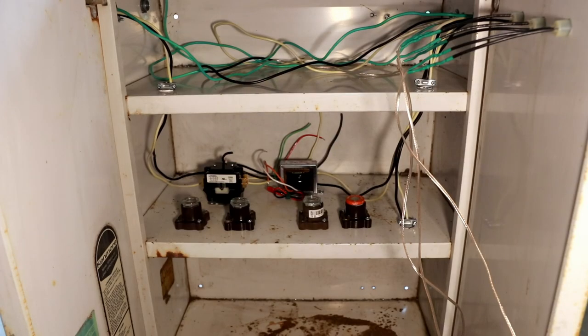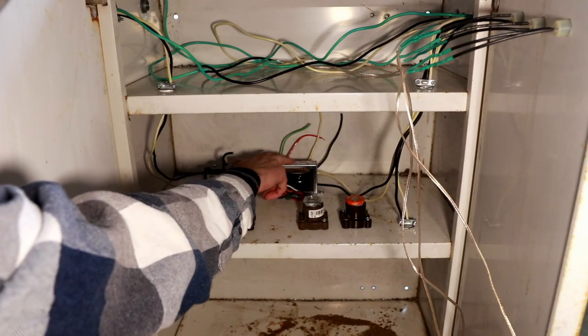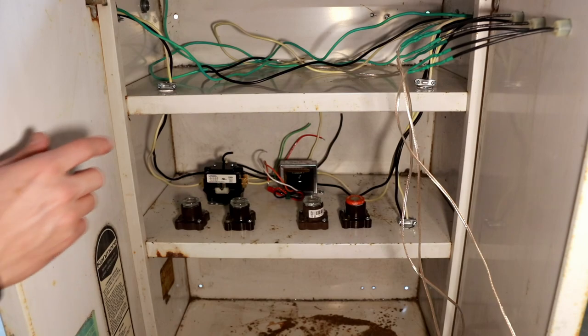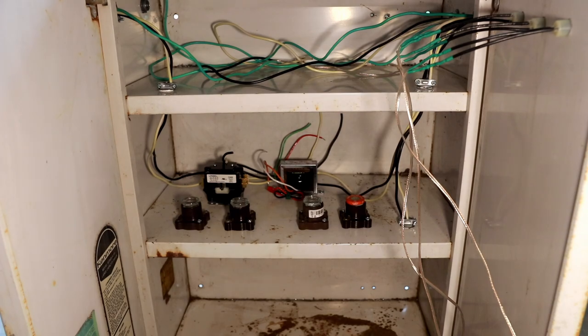Here's a view of the inside of the cabinet with all hardware mounted and bolted in place but none of the wiring hooked up yet. I have the main contactor, the 24 volt supply transformer, the four fuses, and I've also mounted Romex clamps for strain relief that will allow cables to penetrate from one level of the enclosure to another.